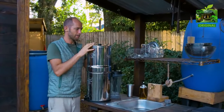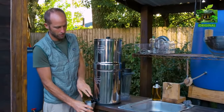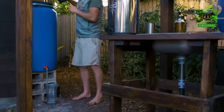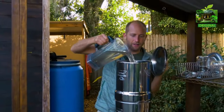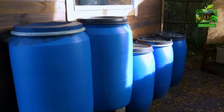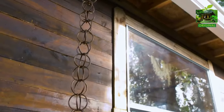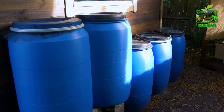Also here is my drinking water. It's a pretty great system called a Berkey, and this can be used for purifying rainwater, water from lakes and rivers, or city water. I have my rainwater barrels right here behind the house. I simply stick a pitcher down here and my rainwater is purified to be delicious and great for drinking. Rainwater harvesting is very easy — not complicated at all. The water just falls down onto the roof into a gutter. Instead of a downspout, I have a rain chain. The water falls into this barrel and is stored right there. I have multiple barrels and they're simply connected by a pipe.